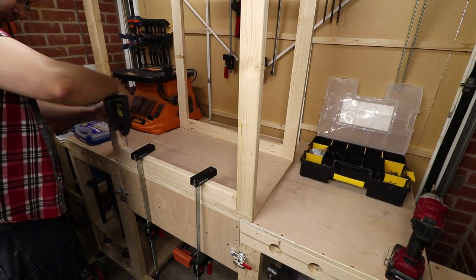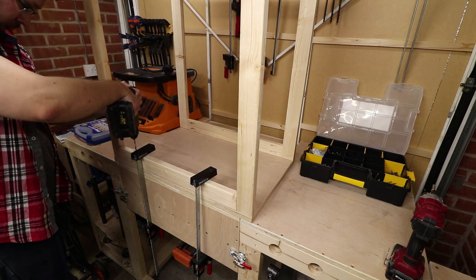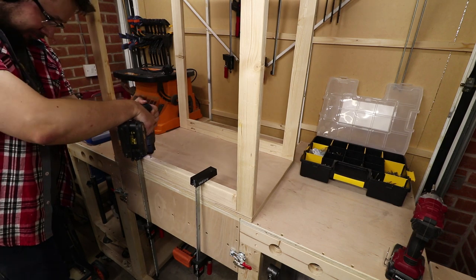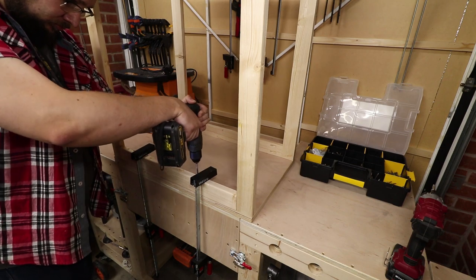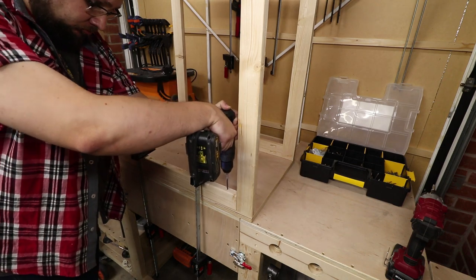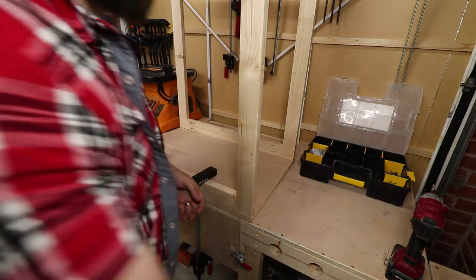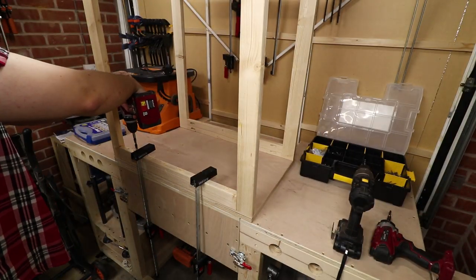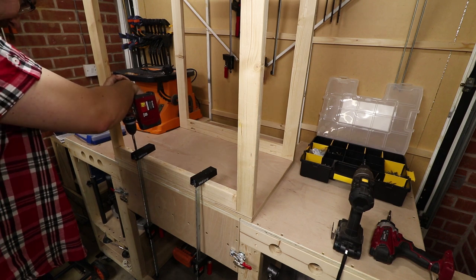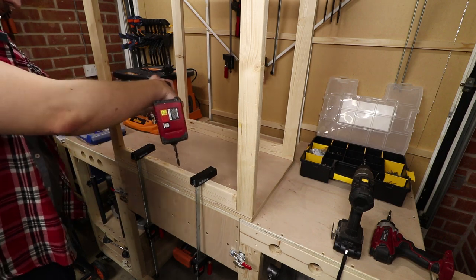Second cart, exactly the same process, although we do not have the stud support on the bases. As you can see, the legs, the sides, are basically screwed into the tops and bottoms straight away. Hence, that's why we actually doubled up the plywood here. Again, it's because I need every single inch to be able to squeeze it into the designated space. If you're not confined by the space, make your own measurements and make it to fit your needs.